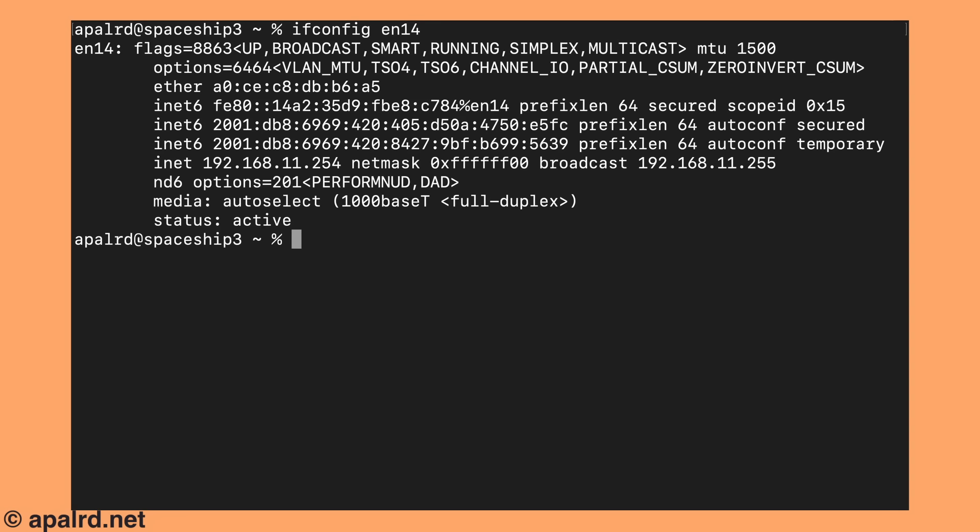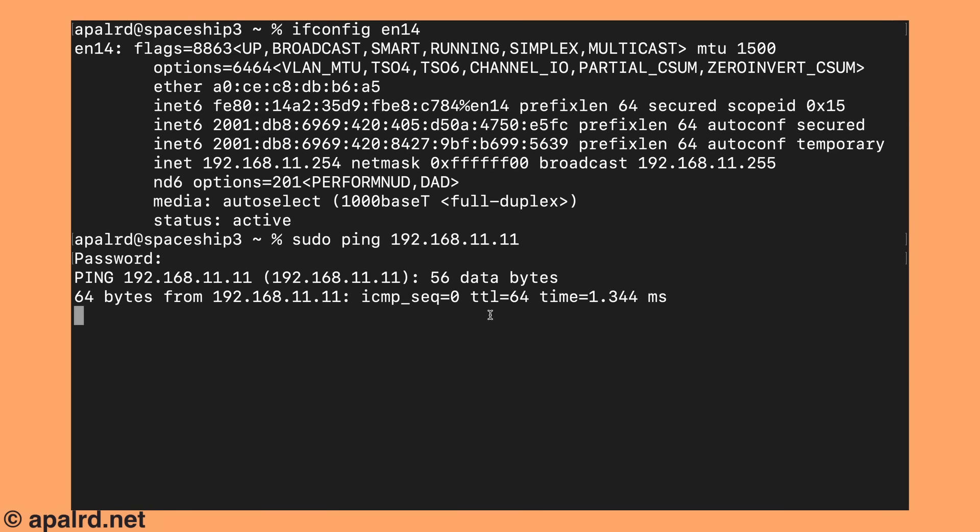Now that I've got it set up, all I've got to do is connect to it. Out of the box it comes with a static IP address, which was written down in the information. It also supports IPv6 enabled by default with stateless auto-configuration. If you know the MAC address — which is not on the sticker by the way, so you'd have to figure that out separately — you can determine its IPv6 address because it uses EUI-64. Over here on my laptop, I look at ifconfig. My IP address is in the .11.0 range, so it defaults to 11.11. Ping works just fine.